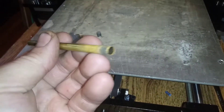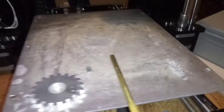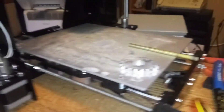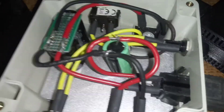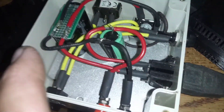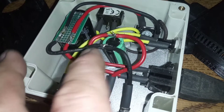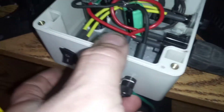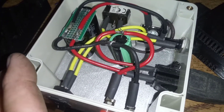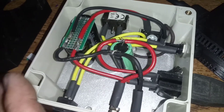This is the electrode I used — brass worked much, much better. Also, it wasn't turning; it was just stationary, plunging down. You can see the capacitors are gone — I had to take out the dual capacitors on the electrode side. This is the filtered side, just filtering the DC coming in after the lamp. I put a capacitor — I forget the size, probably like 150 microfarad — and it made all the difference in the world as far as the arc goes.